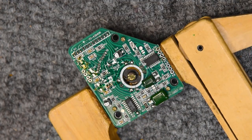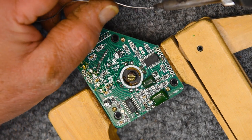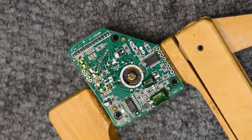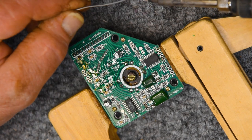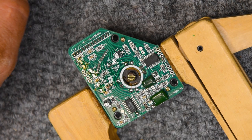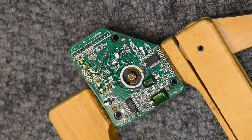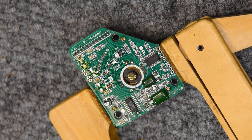Okay, so like I say, it works great, but it does require a little bit more dwell time. That low temp solder has to get underneath that SMD, and so it's not the same as doing it on a chip or on a surface mount component. It takes a little bit longer on this, so it's not my favorite method.